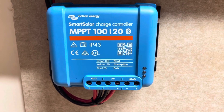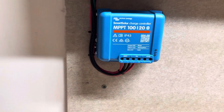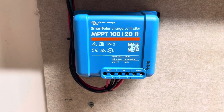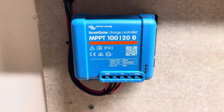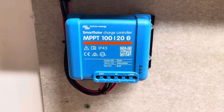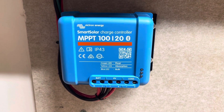That being said, they don't work too well with the MPP Solar inverters. I found out that as these things charge like gangbusters and the MPP Solar system starts to get near absorption or near the top of charge, it starts folding back quicker and these keep going, so you don't get full charge. This little thing just keeps trying, but if you have a bunch of other solar panels, for some strange reason it seems to fold back early. So I don't recommend using these unless you've got an entire Victron Energy system or something else that might work — but I know it doesn't work with the MPP Solar.